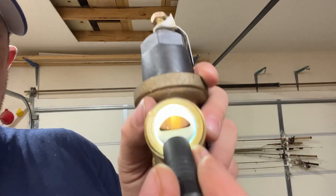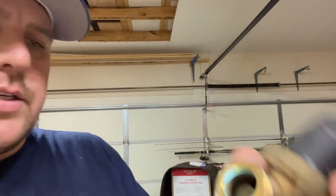This is kind of like our first or second line of defense. It goes through your check valve at the street, comes into your pressure reducing valve. Inside of this valve there are screens. If a lot of sediment comes in, it will restrict the movement of that inner valve up and down and cause it to lock open or closed. If it locks open, all the high pressure from the outside comes rushing into your house. You'll know from a couple of different key indicators — you'll have your toilets constantly running.